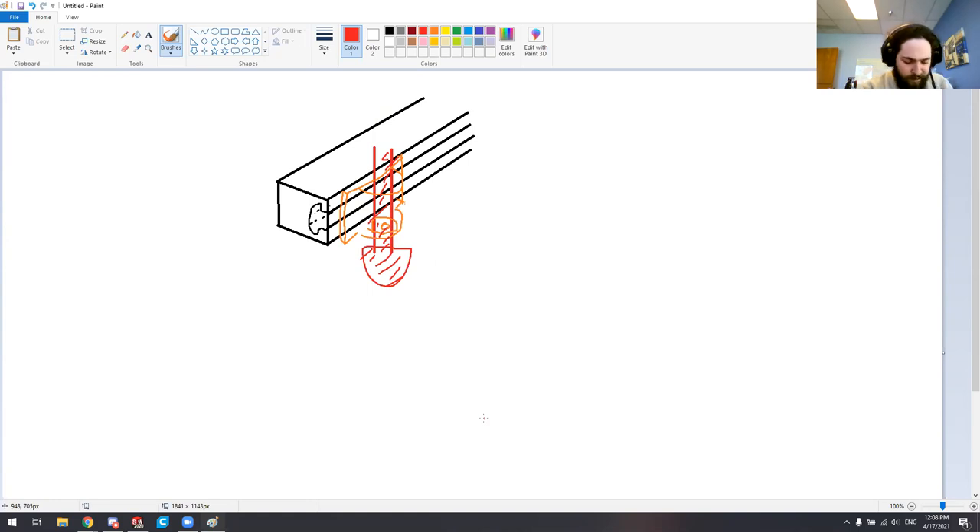One of the other things I'm going to do is integrate a small bubble level insert. We'll measure the diameter of it and make sure to dimension things properly. That'll sit towards the top of the part. This gives you a good overview of what we're designing — a bracket shape that attaches to the 40-40 aluminum extrusion with a nut to take the load and an integrated bubble level.